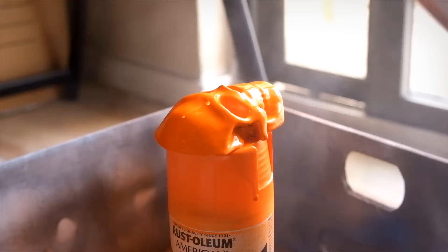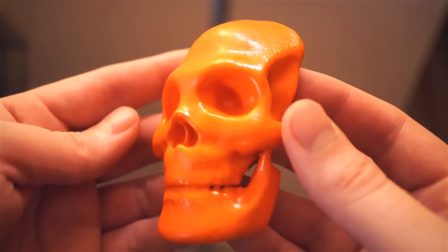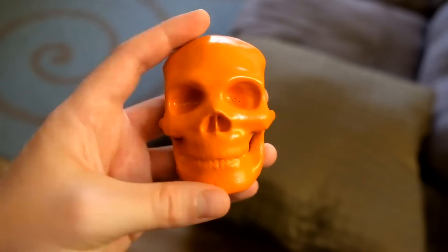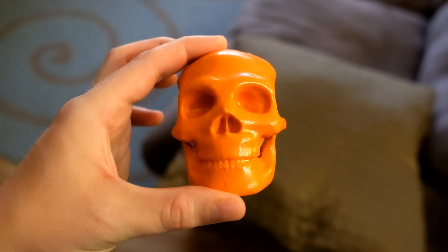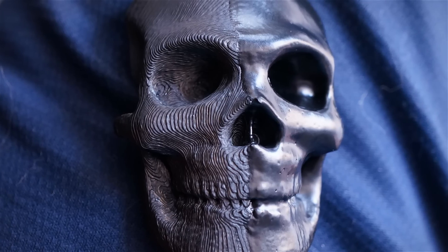What is happening is the paint and polyurethane will combine and thicken, then set under the fan and fill in the layered gaps. For best results, I do this in several thin layers, waiting about 20 minutes for each layer to dry. Then I wait a full day before adding the final coat of spray paint to cover up any discoloration.